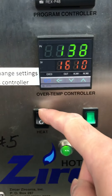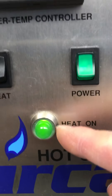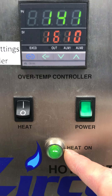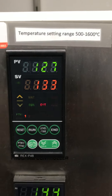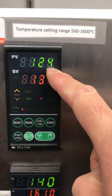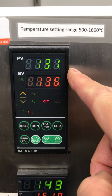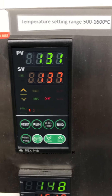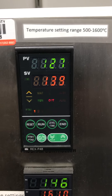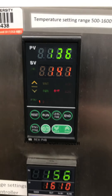Make sure the heater is on and the over-temperature setting is reset. You can see the heating LED is on — if this one is off, there is no heating. Always look at the temperature before you leave. Make sure the temperature is rising — the present temperature should be maybe higher than room temperature. If it doesn't increase, that means something is wrong. Note that at low temperatures it's not very accurate — below about 200 it's inaccurate, but over 500 it will be very accurate.